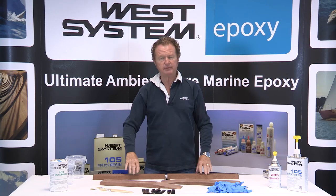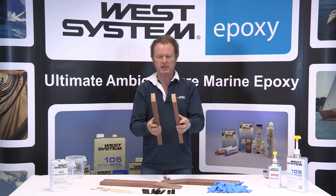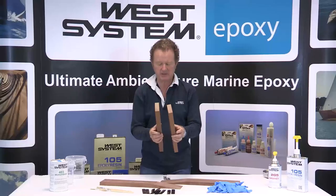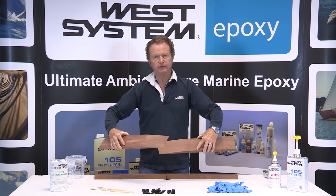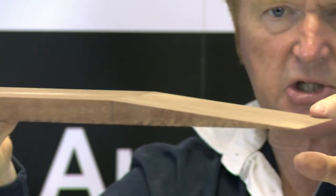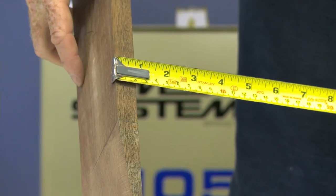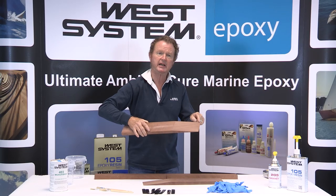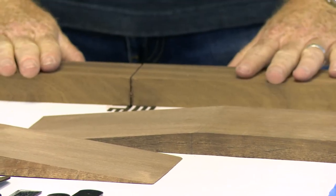Joint design is fundamental to great success when you're using epoxy, and here we have two different examples of good and bad joint design. Here we have a butt joint where we've got two sections of end grain timber — this is a very poor joint because the surface area is very limited. Whereas here we have excellent joint design in the form of a scarf joint, with an 8 to 1 bevel. The material thickness is about 20 millimetres and the bevel is eight times that — 160 millimetres — tapering from 20 millimetres right down to nothing. This broadens the amount of available surface area: very good engineering versus very poor engineering.